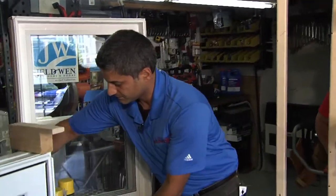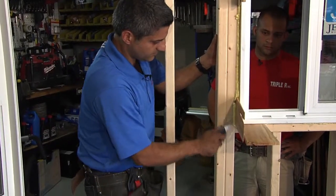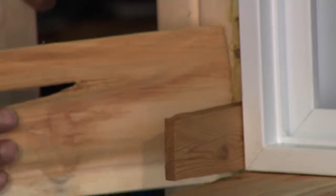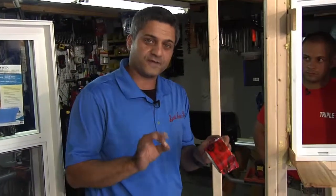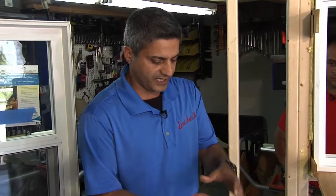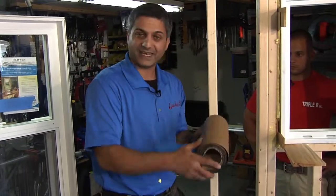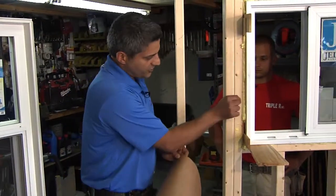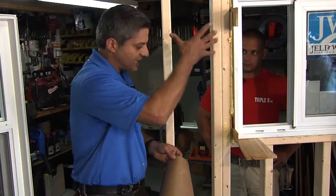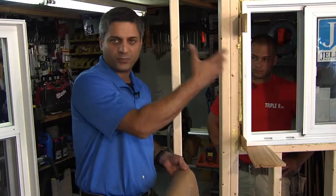We're almost there. What we're going to do now is cut off the shims. Ideally you want to do this after your spray foam is dry, but not a big deal. You're going to cut your shims off nicely all the way around. Now you have a couple of choices about a vapor barrier. At the very least, I highly recommend the tuck tape — you want to get the tuck tape and make a complete seal here. If you really want to go high end and money doesn't matter — remember you've saved a lot by not hiring a contractor — this is blue skin. This product is just phenomenal. You're going to cut blue skin, tape it in here, tape it across, and then your vinyl siding, Tyvek house wrap, or whatever would be addressed under new construction. If this is existing, you're going to need aluminum capping or trim put on the four sides.